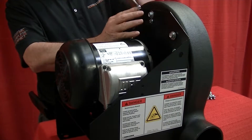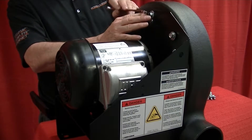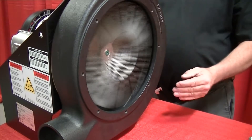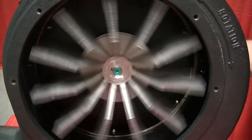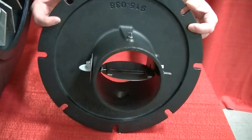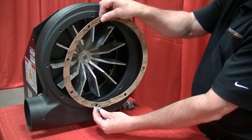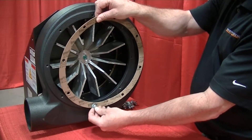Using a wrench, tighten the bolts to approximately 132 inch-pounds. Spin the impeller to make sure it moves freely. Locate the pump inlet and set it aside. Assemble the remaining gasket material and insert a 5/16-inch by 7/8-inch bolt in the bottom of the scroll.